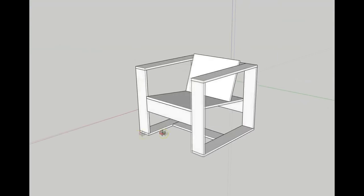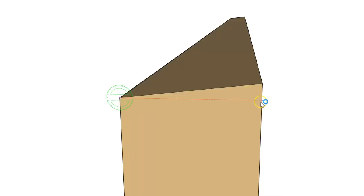At this point I was really happy with the design. In SketchUp you can also add dimensions to the drawing really easily, and that enabled me to write up a cut list showing full dimensions and quantities for each piece that needed to be cut, as well as the angled cuts which I took from the drawing using the protractor tool in SketchUp.